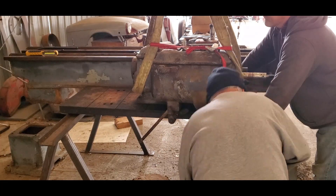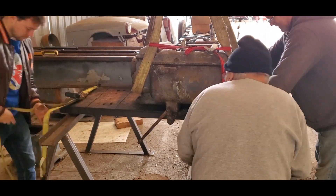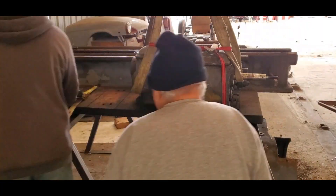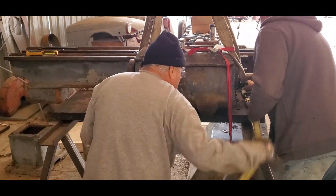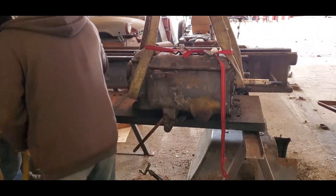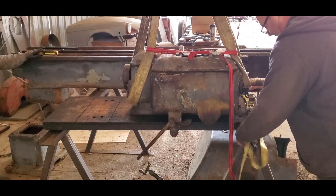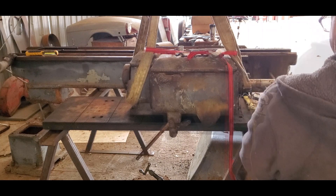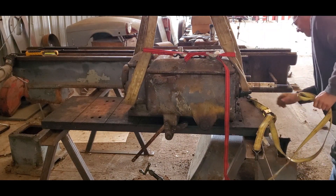The reason is to lay a two-by-four into the inside of the channel, which will project up higher and protect the underside of the lathe bed when we're painting it. I used the strap clamps — the tightening buckle has a two-to-one advantage — to pull that headstock and get it over the other side of the legs.